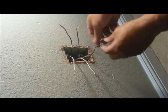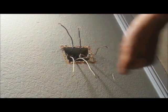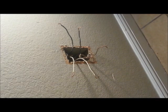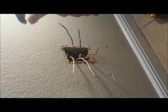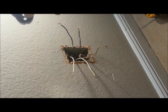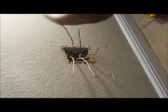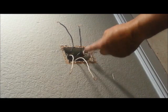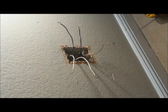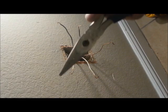If you're using a screw cap, they don't consider that code because you get a tiny little electrolysis that goes across there, and eventually it'll corrode and the ground will break. So let's start putting this back together. In my arsenal I have strippers — you see how you bite down on the sheathing and these little teeth pull it off as it goes back. Otherwise you'll have to use dyke side cutters and ease around the sheath and pull it out. These are crimpers, and this is what I meant about that little bonding collar — it'll sit in here, crimp it, and now it's bonded.